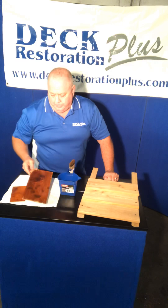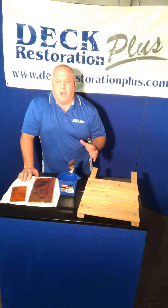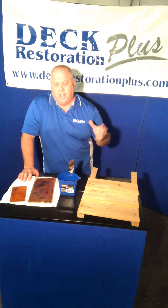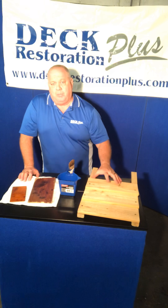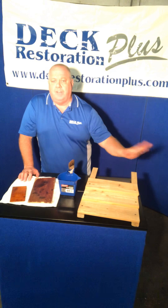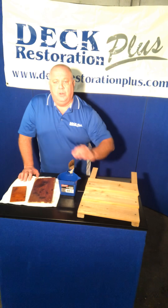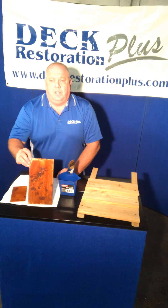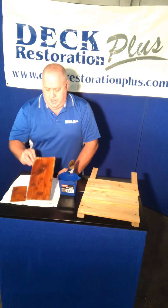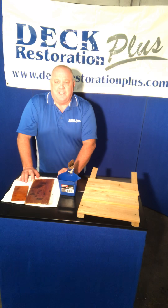To summarize: if we're staining or sealing our wood project — whether it's a deck, a fence, wood siding, or a log home — we want to start from the bottom up. Any drips we brush in, no harm, no foul, you see nothing. If you go from the top down, that's your first coat; subsequent coats, it'll show up like this. That's your tip from the Wizard of Wood, and hopefully that'll help you seal or stain your next project.